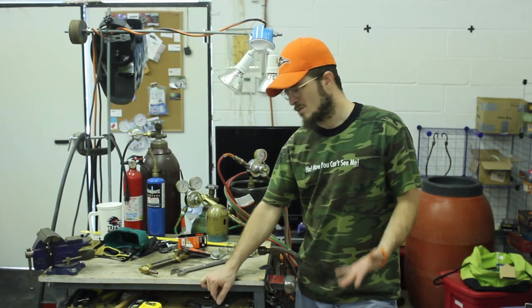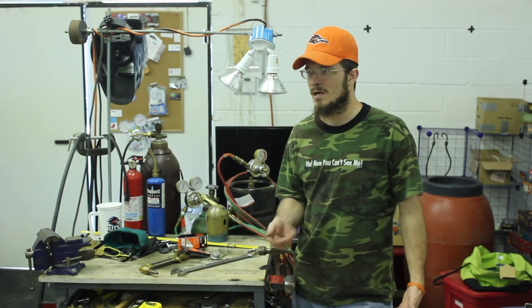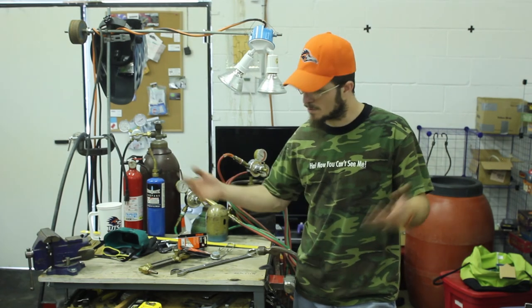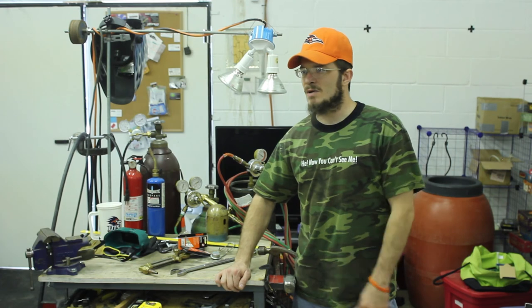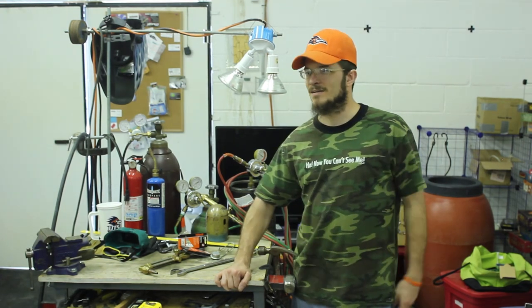When you heat it up to about 500 or 700 degrees, it vaporizes and it turns into this white smoke. And it's just freaking bad for you. Don't inhale it. It's known as poisonous in the metalworking world. It's like a toxic metal or something? Yeah, I guess zinc, when it's vaporized and you inhale it, it's not good for you. But when it's in your Cheerios, a little bit, it's okay.